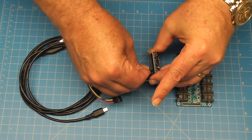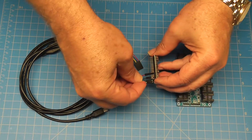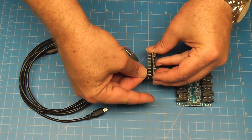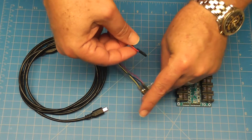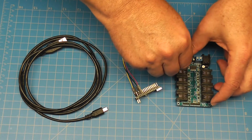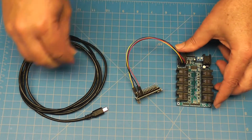To disable the Arduino from booting, use a jumper between the RST pin and ground. Connect the other end of the wire with the 4-pin header to the IO Expander with the black wire closest to the edge of the board.